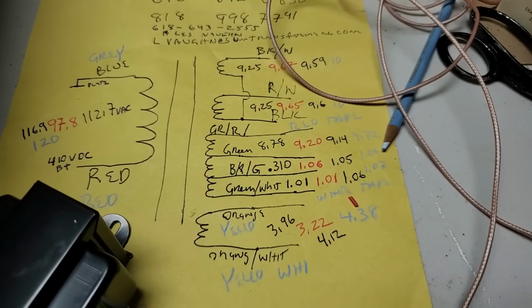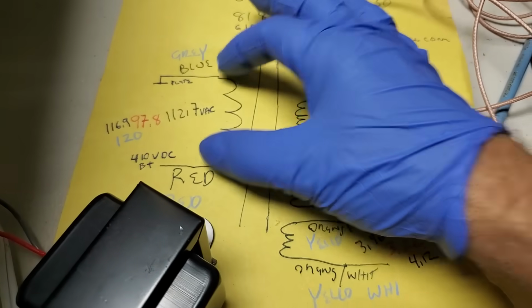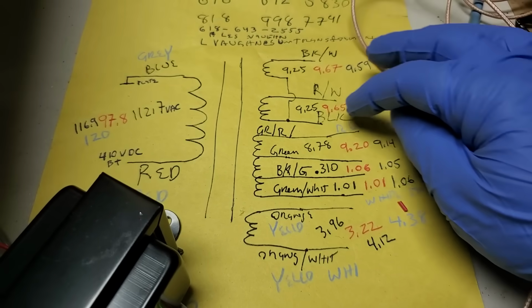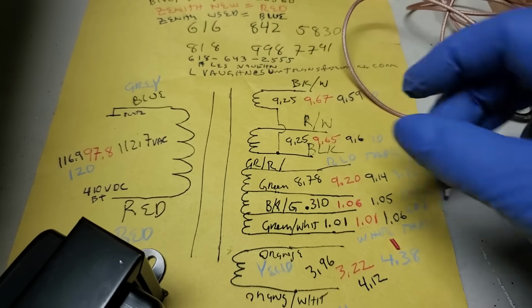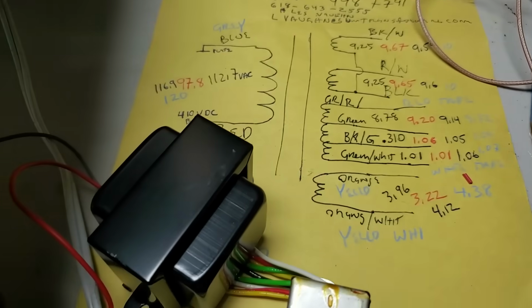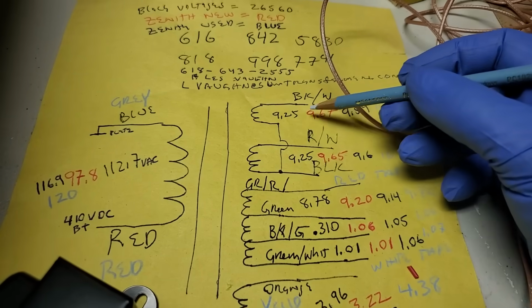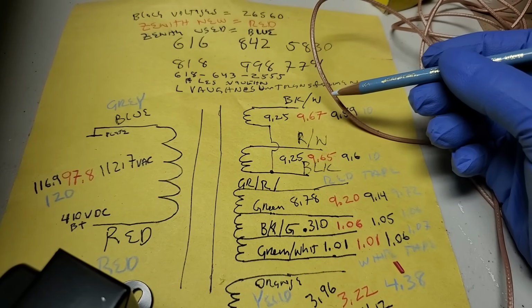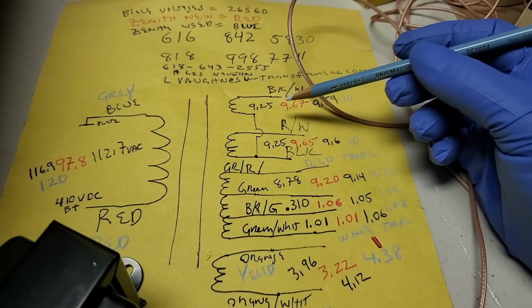Man. So again, just to clarify, the correlation of this coil, this coil, this coil are fine. The correlation of this coil right here is backwards. These need to be reversed. But again, this connection is internal, and I really don't want to open these beautiful transformers up. Basically, there's a resistor that goes between here and here, which is the centering control. I wonder if I could just flip it and leave one of those out. I'll have to look at the schematic.